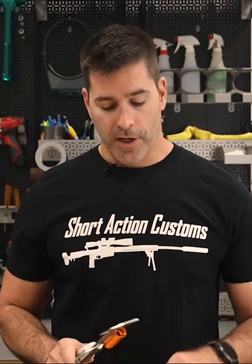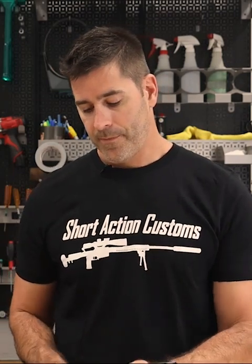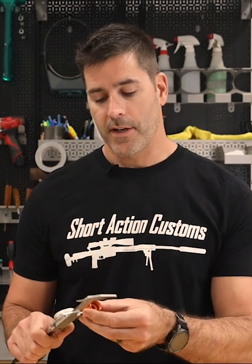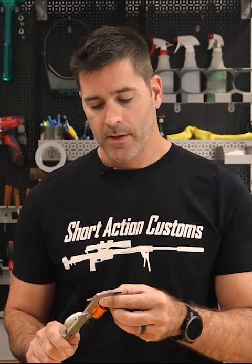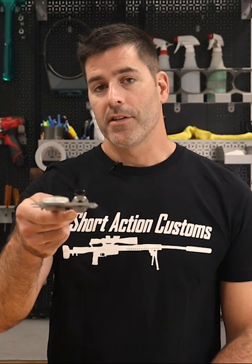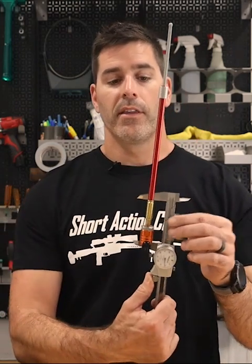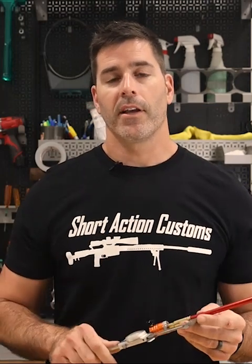In the case that you're going to use something like an overall length tool like this, this slot is not centered, therefore you would set the thumbscrew on the O side which stands for offset. We're going to clamp that in our dial caliper and you can see right here that it's not centered — it's offset on the insert. That's actually what you need when using one of these tools; it will get this whole assembly perfectly straight and centered so that you can take accurate and consistent measurements.